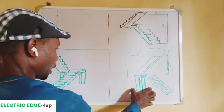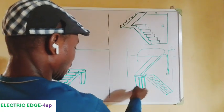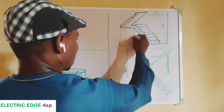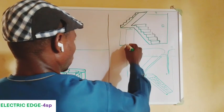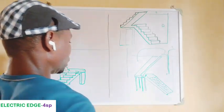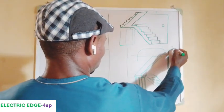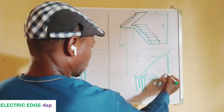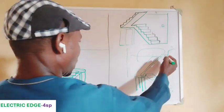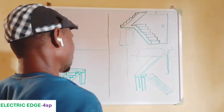For instance, if you want to use the area under the staircase as a mini storage space, you put a small door there. All you need to do is put a lighting point there to take care of the bottom of the staircase. Then from the circuit closest to the staircase, locate a switch where it will be accessible to anyone using the staircase, and from there run another branch — cracking the wall to hide the conduit pipe inside.